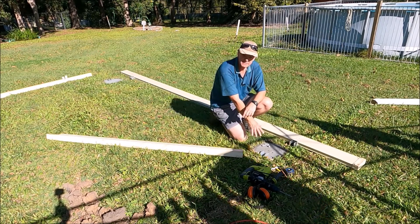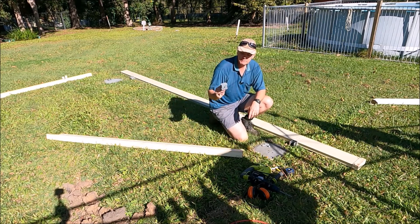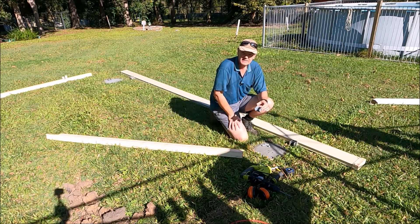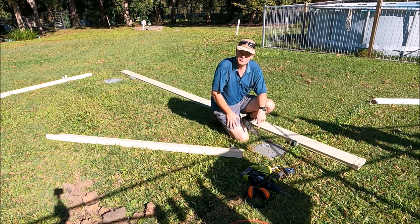It's been a couple of days. The concrete is now nice and hard, so it's time to install our brackets and our posts. We've got a couple of brackets that fit up inside the metal posts — they just have a hole through the middle and we'll bolt that to the concrete. So we'll drill these holes and get these posts installed.